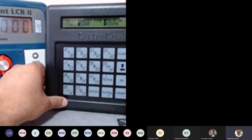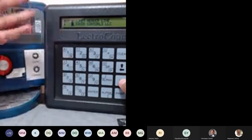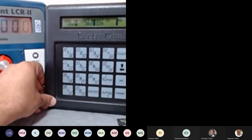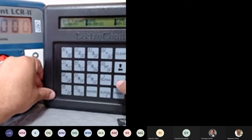Yeah, Teach, I have another question, sorry. Sometimes you use the arrow keys and sometimes you hit the M with the little number sign next to it. What's the difference there? Well, the M pound will actually take you to the whole next section of the same feature. The M1 key is going to take you out of that particular menu. So say I'm on general setup, I'm going to hit enter. I can use the arrow right key and scroll through each field and go to the next section, but I can also hit the M pound key, so I don't have to press the arrow right key multiple times. I can just change to the next slide. So see that? I can change the whole menu, but if I want to get out from it, I just have to hit the M1 key.